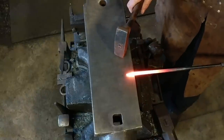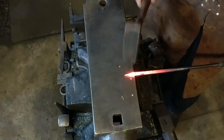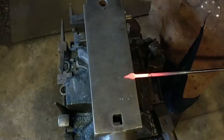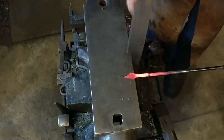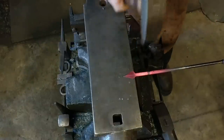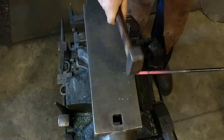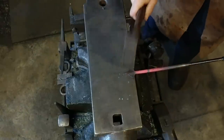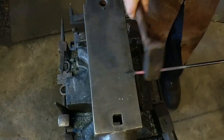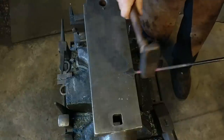So here we go. We're going to go half-on, half-off blows. You're going to set it to where about a cube of material is on the anvil. This is 3/8 inch round bar, by the way. And then we're going to take and just draw out these blows. Essentially what we're making is a spade shape — flatten it out.